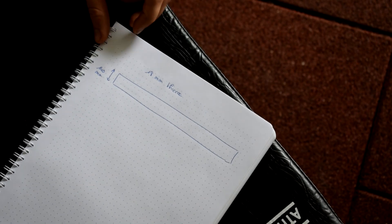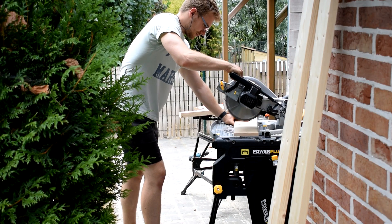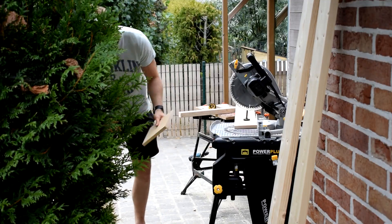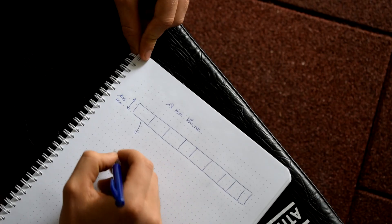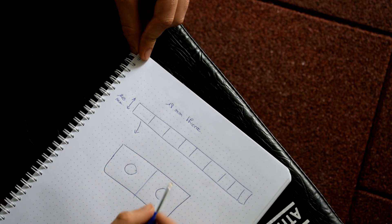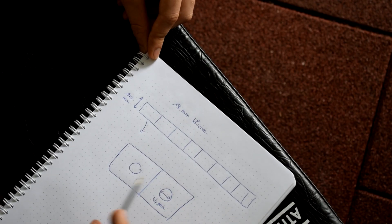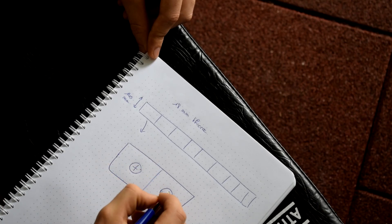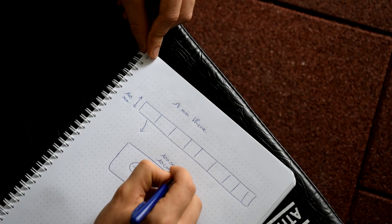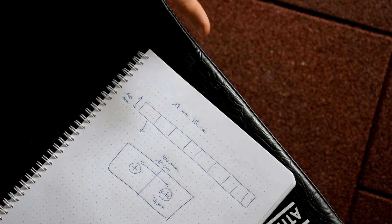I cut this up into equal lengths of 20 centimeters. I was lucky enough to borrow a table saw to do this because doing it by hand is a very difficult task. With each and every piece, I found the center of it and then I drilled two holes that were symmetrically along this line. They were 44 millimeters wide in diameter, and the middle of these two holes is about 100 millimeters apart. That's basically how I made this one — rinse and repeat until you get to your desired height.